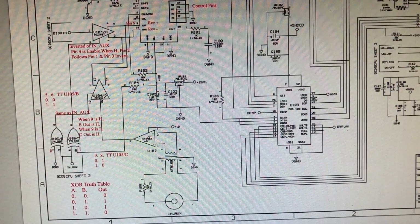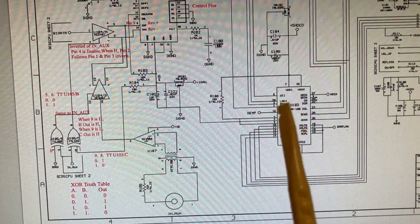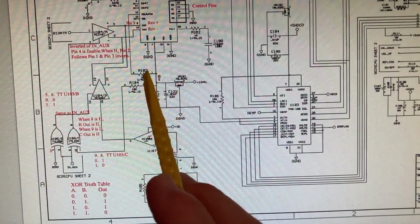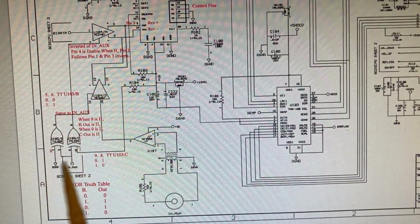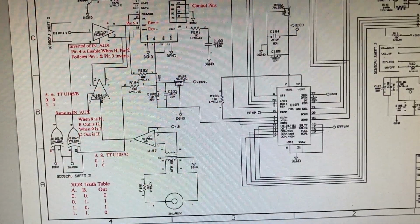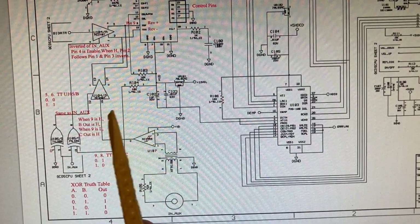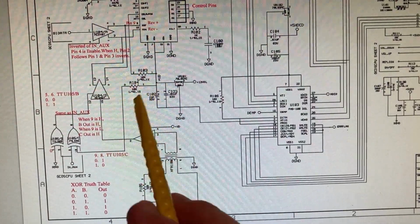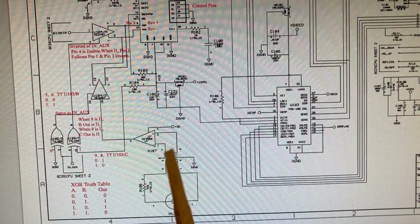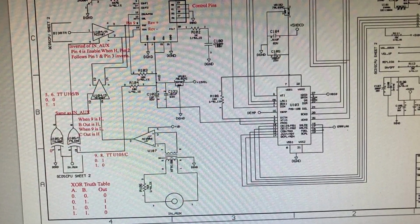So then I started looking at this circuit a little bit, and if it's showing a true 0, we can see it's probably not caused by these chips, which are also fed by the 5 volts, because there's this 10K resistor. If there was a short on this side, the 10K would drop some voltage and we'd see something here other than 0. I also checked, of course, these two capacitors to make sure they were not shorted, and they were not.